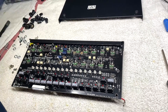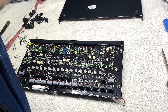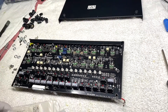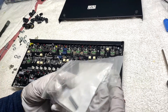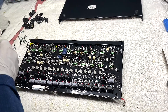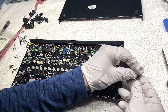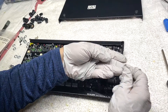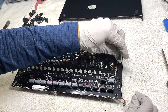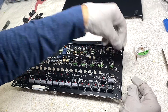Now that you have the unit out, all you're going to do is add the resistor — it'll be linked in the description — and you're going to add it to this placement right here. I think it's a 2512 size, but it'll be confirmed in the description. It's a very large resistor. You may want to use solder wick to remove solder from one or both pads first. It's a 1k resistor.